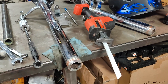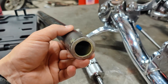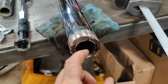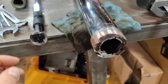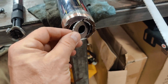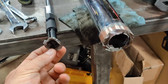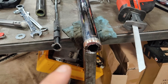This job would have been a lot easier had it not been previously fixed, but that's where we are. I did get a new piece of sleeve material — this is inch and a half DOM steel tubing. My first attempt of using a reciprocating saw to cut slots and try to break the sleeve out failed. The second attempt of welding in a large fender-style washer and then using a slap hammer style puller just deformed the washer, eventually broke the welds, and so now I am on attempt number three — hopefully third time is the charm.